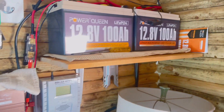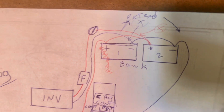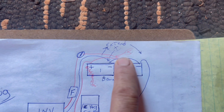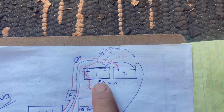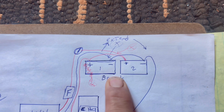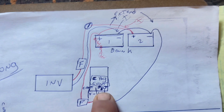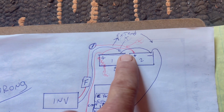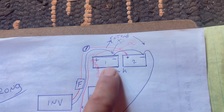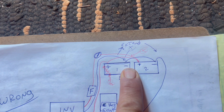I've done it wrong and here's how. I've got the negative to the negative, positive to the positive — that banks these two together. That's correct. What I did wrong — at some point it was correct but I don't know when I changed it — I ended up going out to the charge controller from this negative, and at the same time going out from this positive on the same battery to the inverter, and then reversing that here. So I ended up using all four terminals to go out. No wonder I'm having problems. That's incorrect. You can see I have a fuse here, and I've got a fuse here and a switch here.